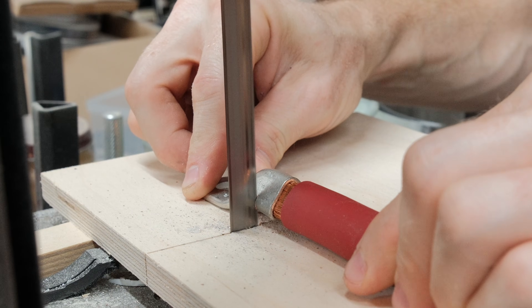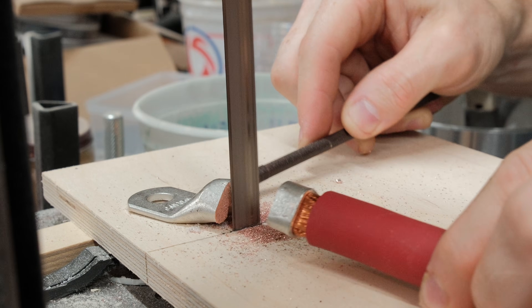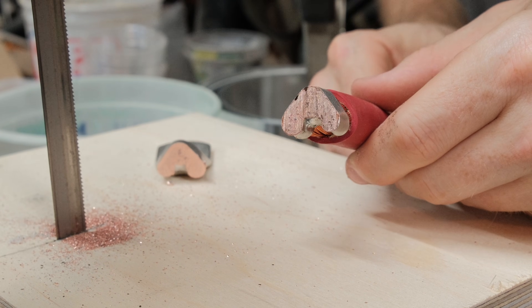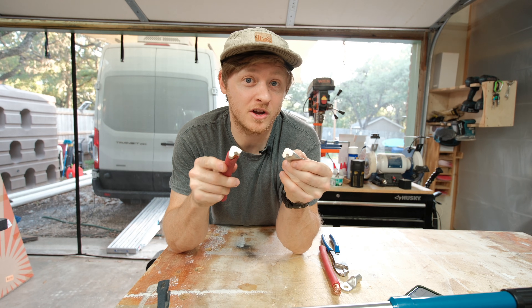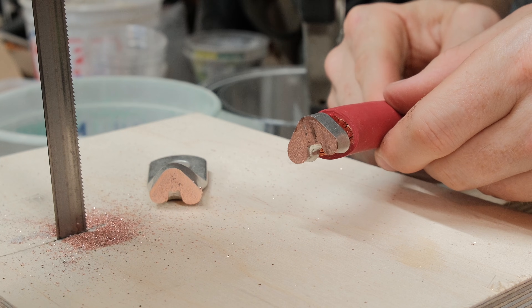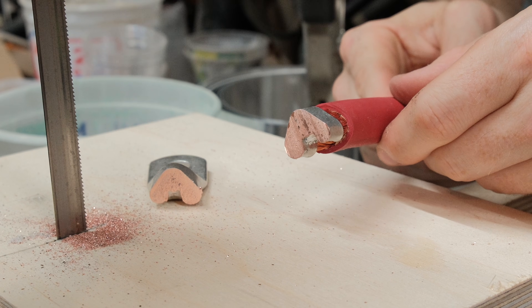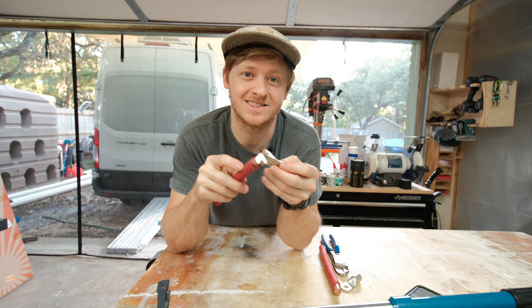To do this, I'm going to slice through it using a metal cutting bandsaw. See how the copper is cold welded together? There's no air gap in there and no loose strands. That's what we want — all those individual copper strands are now one solid mass of copper inside the lug. A rock-solid and low-resistance connection.